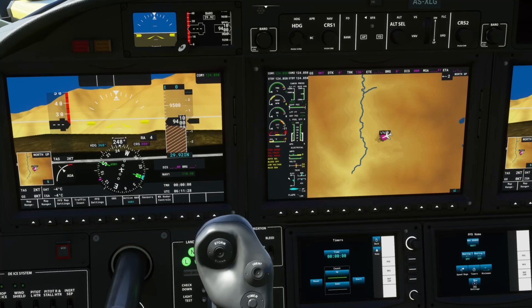Alright, now at the moment we've got a battery voltage of 24 volts. Now the longer we keep talking and not starting the aircraft, it's going to go down. It will actually start at 22 volts. I've even started on 21 volts before, but it's good to have good battery voltage. We aren't going to get 24.5, that's the maximum we'll get, because good battery voltage means that you've got good NG rotation and acceleration during startup, and it just overall gives you a better startup of the engine.